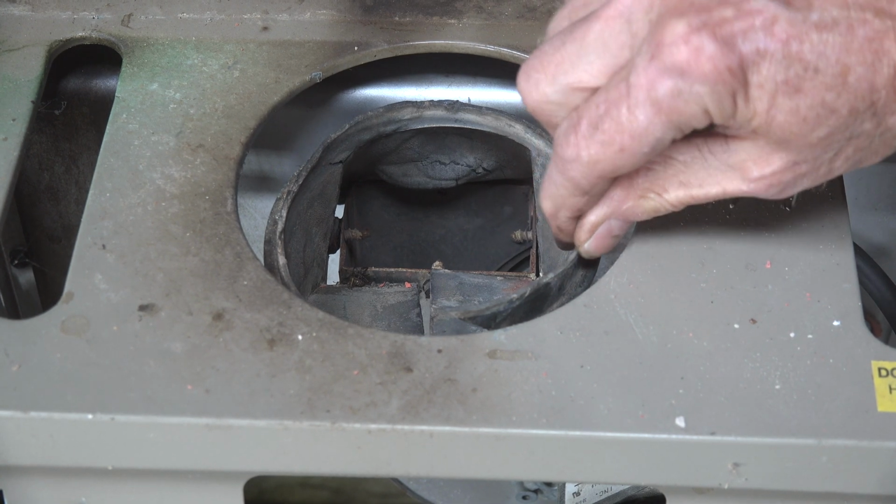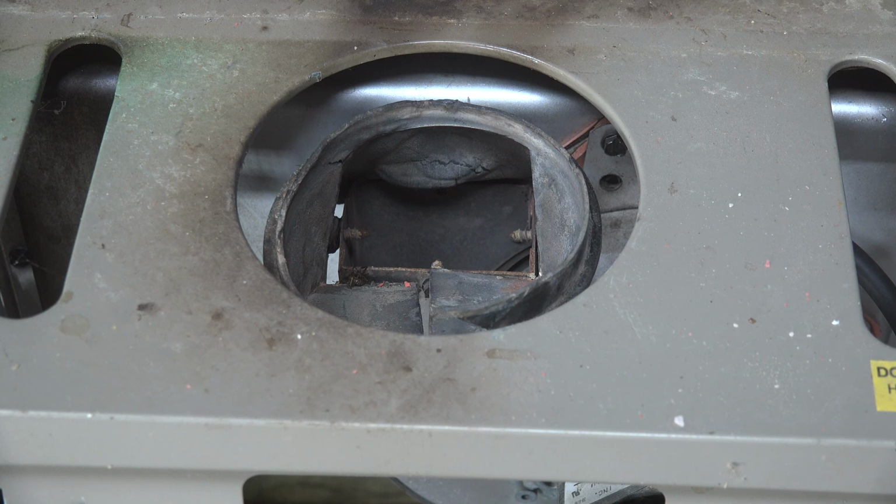Now, we ordered parts for it, we ordered a new adapter. If it had been my choice, I would have replaced the entire furnace, but I don't make decisions all the time on things like that, so that's how it ended up being. But the furnace was misused. So, jumper limit switch. All kinds of things can happen if you jumper a limit switch.